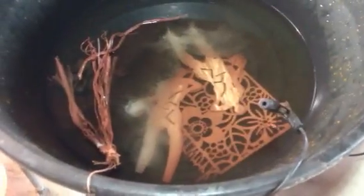This has been in the plating solution for about 5 minutes right now. As you can see, the material is plating quite nicely. Some of the copper will precipitate out as a powder and will be washed off, and then it will be plated a second time in order to really set the copper.